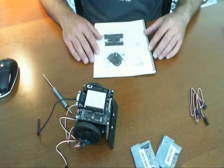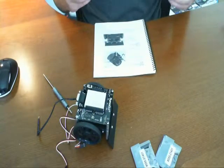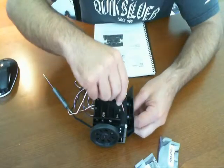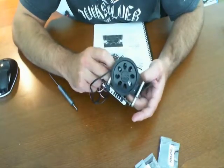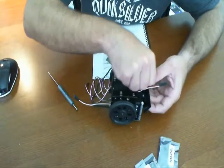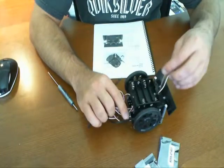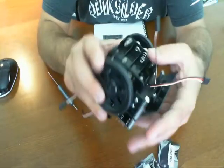Now step 9: we have to install these. It says to carefully feed each 10-inch 3-pin extension cable through the center chassis slot. For this we're going to have to turn it side down — there's a slot right there in the middle. These are pretty big and only one fits through at a time. I'm going to make the assumption that they're going to go through to the back, and I'm going to feed it through to the back, simply because that's where all the cables are going. These are going to be used to connect to the line sensors in step 10. There we go — now fed them in, and we have the two wires sticking out.